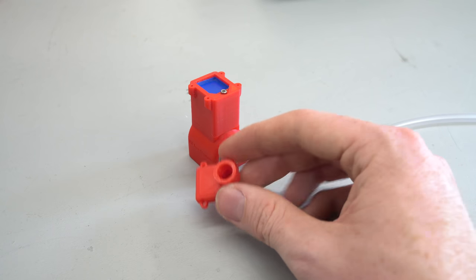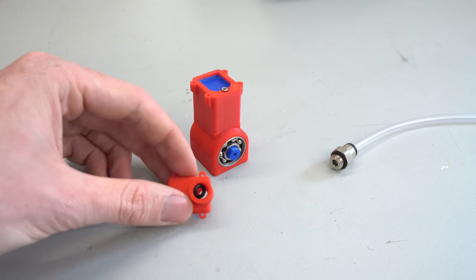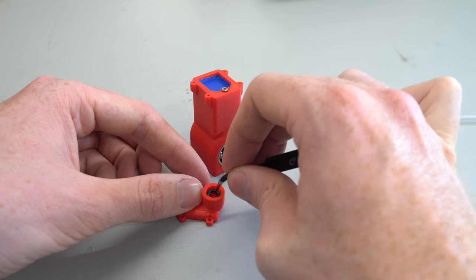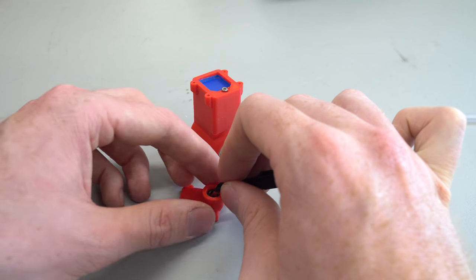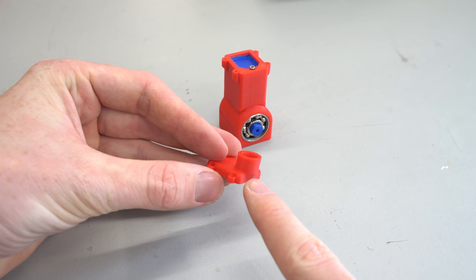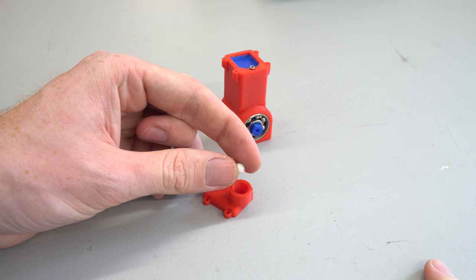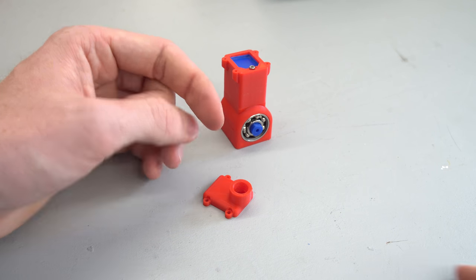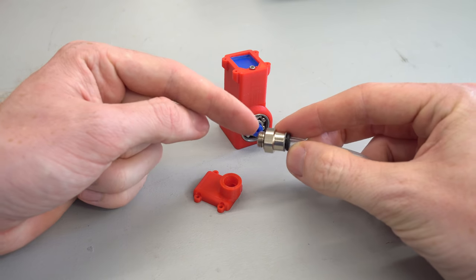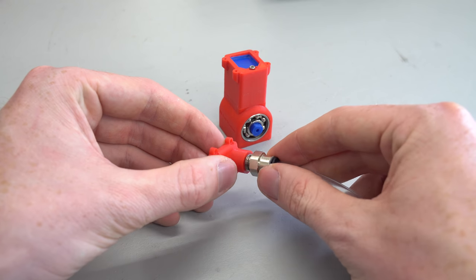also the O-ring will. So what I'll do is I'll place the O-ring in like so, push it down to the bottom and make sure it fits in nice and snugly. So now you should be able to see the O-ring in the underside of that valve system, and I just need to insert the pellet gun 6mm ball bearing just in the top there.